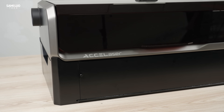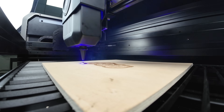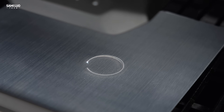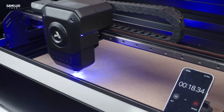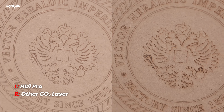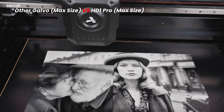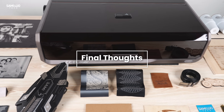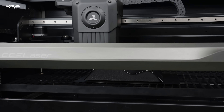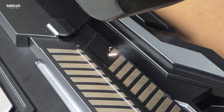Let me summarize the engraving and cutting capabilities of the HD1 Pro. For cutting, I wouldn't say it fully replaces a dedicated CO2 cutter — from my testing, it delivers about 70 to 80% of what a CO2 cutter can do. But compared to galvo engravers, it's no contest; the HD1 Pro completely outclasses them. In engraving, it offers a level of speed and precision that CO2 lasers cannot match — significantly faster and without overburn marks, resulting in smoother, more consistent engravings. The massive area engraving is something galvo machines simply cannot do. The X-Lazer HD1 Pro brings together features that normally require multiple machines. Its nozzle-assisted airflow gives it surprisingly capable cutting, the galvo laser provides the fastest and most precise engraving possible, and combined with its LiDAR-guided Z-axis and advanced motion system, it unlocks true 3D engraving on curved and tall objects.